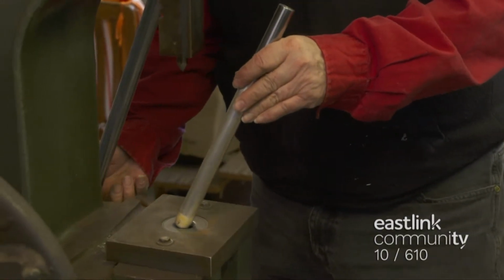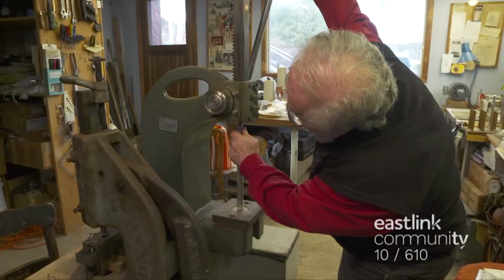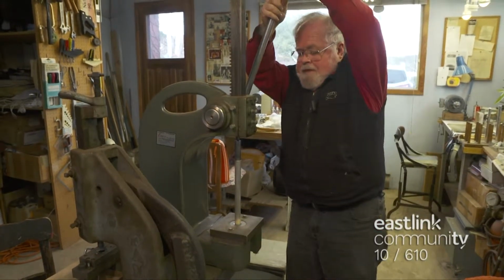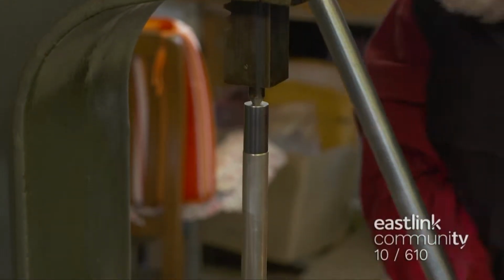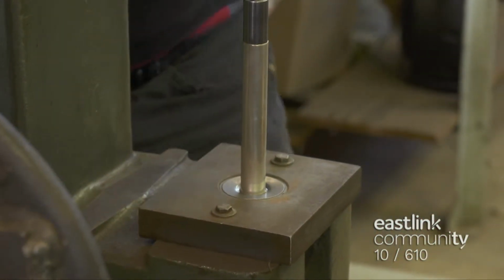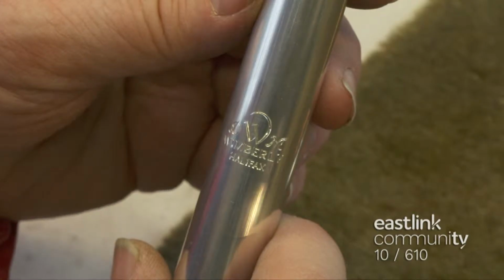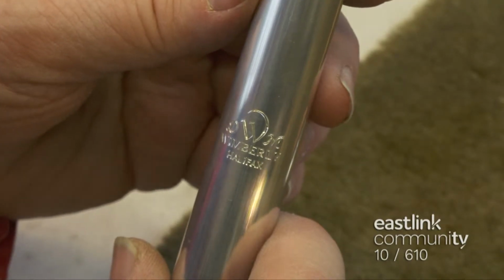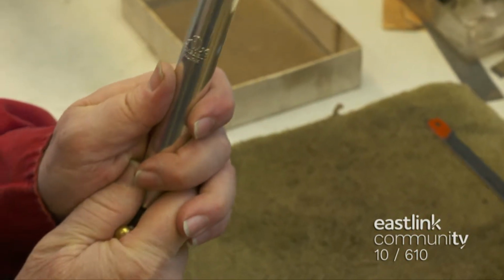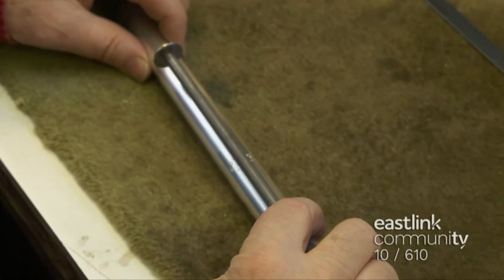The silver tubes arrive in a basic form and need to be pulled into the proper shape. A mandrel is placed inside the tube and is loaded into an arbor press. Using over 2,000 pounds of force, the tube forms to the outside of the mandrel. Each tube is engraved for Wimberly Flutes by local master goldsmith Don Bell. The diameter of the silver tube is measured precisely to 0.684 of an inch to position the embouchure hole center.